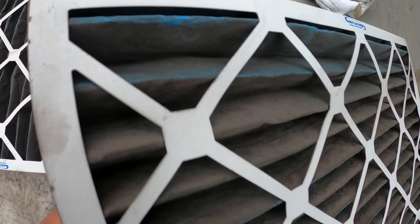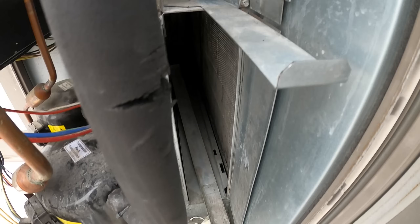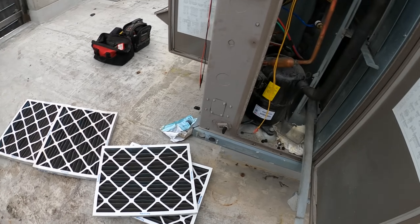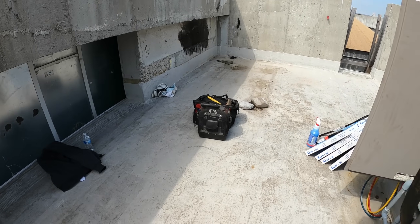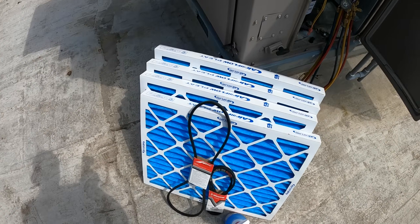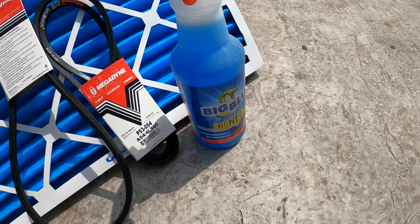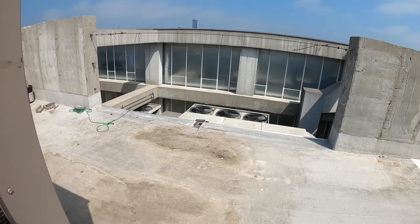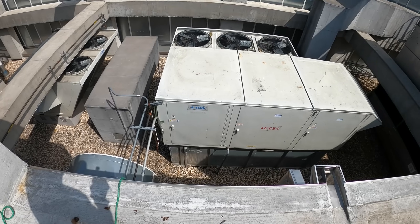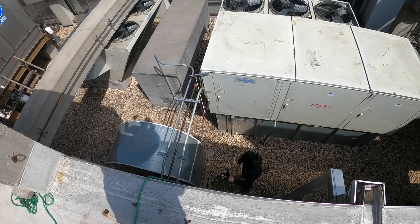The filters are jacked up — broken belt, dirty clogged filters. You can see a ton of tears across this belt. We've got new filters provided by the building. I also want to pick up a belt, and I've got a spare to leave in the unit for the future. Also got some leak check supplies and Christian is here to help.